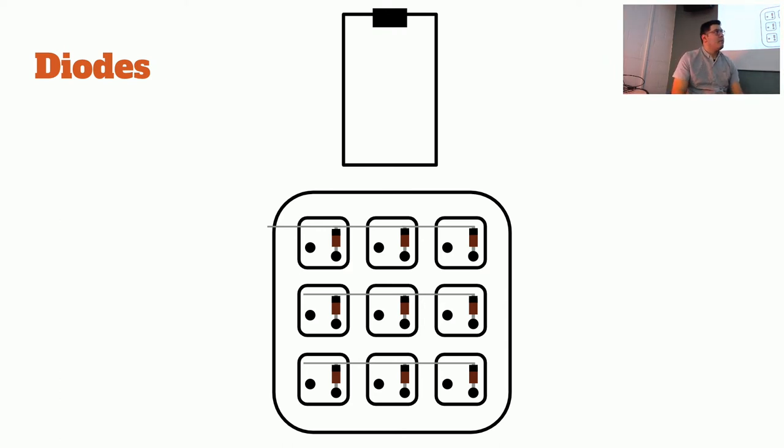Well, people still do it in R&D stuff when you need to proof a circuit. And it's faster once you know how to do that than to design and etch a PCB and solder up. Right, if you want to change something out, you just unwrap it. So it's a non-permanent way, but still a very sturdy connection. Yeah, it's a very solid connection, and it's still in use. People are still hand wrapping circuits.